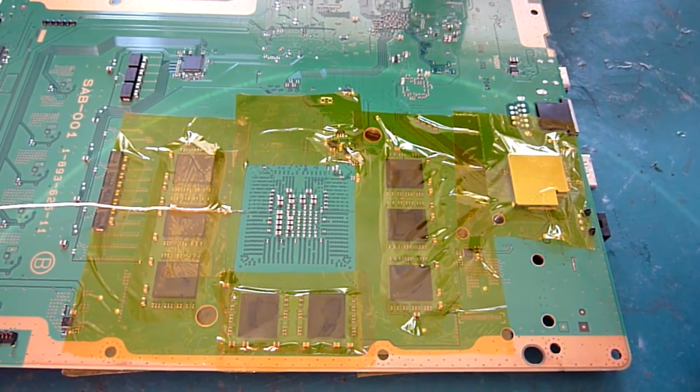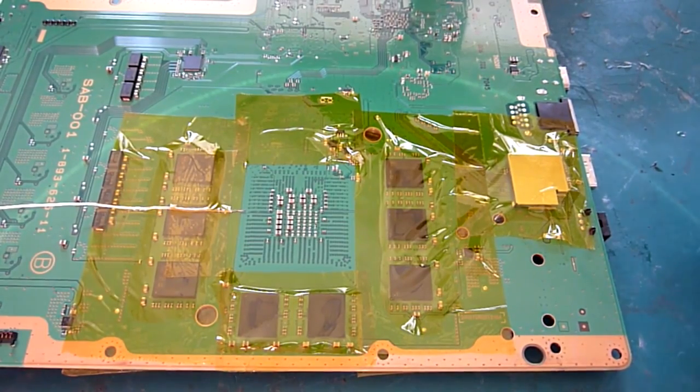It helps to have more than one sensor on there, so most machines have a capacity for at least 2. Mine has 5, but I only use 2, one for the top, one for the bottom. That'll make sure we get a nice even distribution of heat through our PCB, which will mean we can lift the chip successfully without pulling any pads off the BGA or the board. If we pull pads off the BGA, it's game over. If we pull pads off the board, it can be salvaged, but it is a real pain, and we want to avoid that where possible.